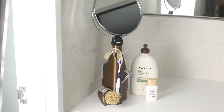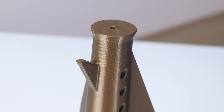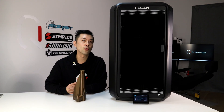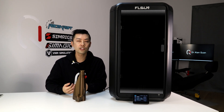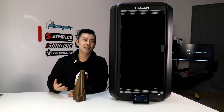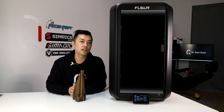The next thing I printed was a shaving mirror stand that also holds my toothbrush, razor, and nightguard. This was a good example of compromise — I wanted really good quality but also to see what the T1 could do at reasonably fast speeds. I settled on 400mm/s at 0.12mm layer height, so the detail reproduction is really good and 4 hours for a print like this is pretty good. For comparison, on my Elegoo Neptune 3 Plus we were looking at 24 hours — admittedly that's a 2-year-old printer that doesn't even run Klipper — but it really shows how far the T1 comes. It's really the next generation in print speed.